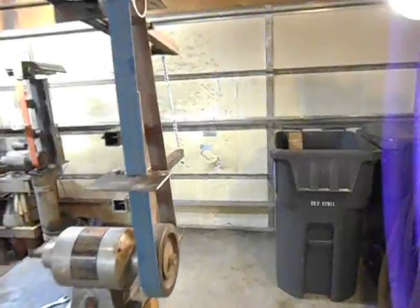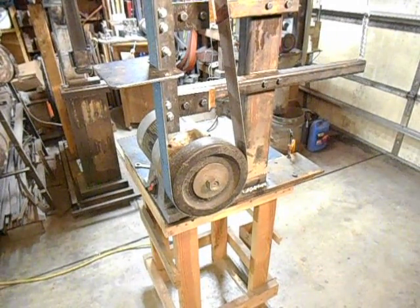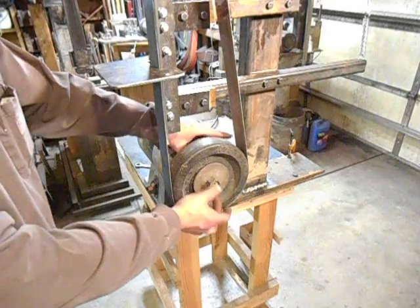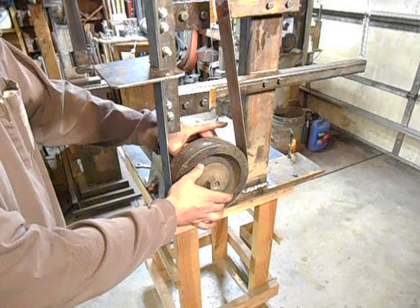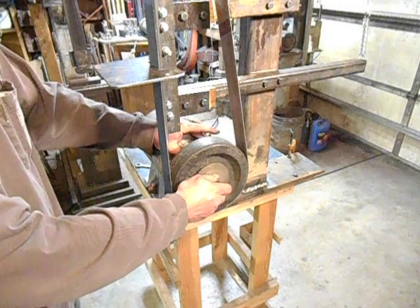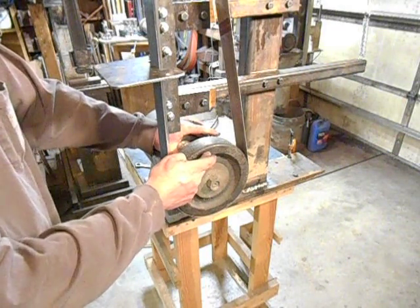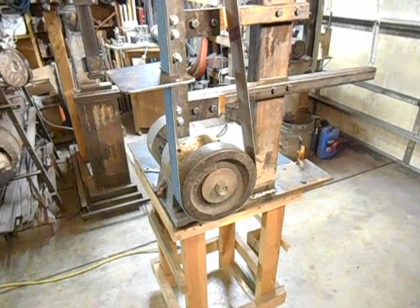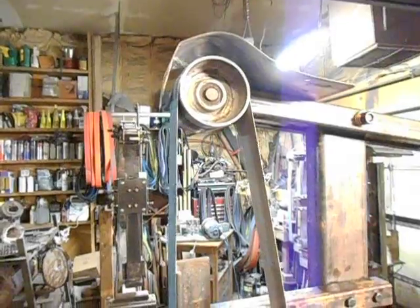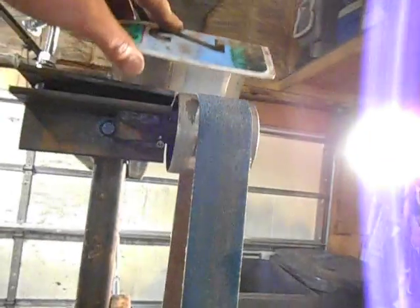The drive wheel here was just an industrial cartwheel I found at the junkyard. It uses the same pinch mount setup that the hard wheel grinder did — basically you take the nut off, flip the washers around, put the wheel on, and tighten it down. I think I had to turn a bushing to fit the shaft on the inside of the wheel. The only other part that usually gives people grief is the tracking wheel. You can make them — they're just a crowned wheel with a bearing and a through shaft to mount to your tracking mechanism.